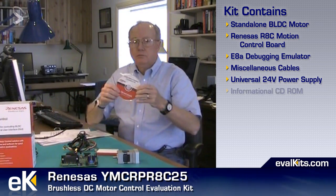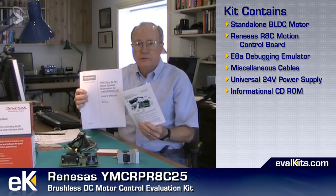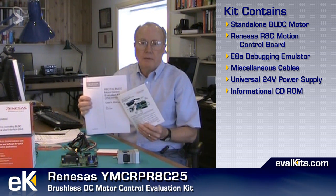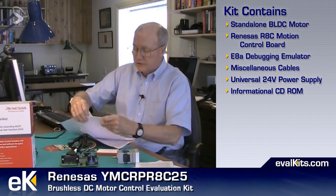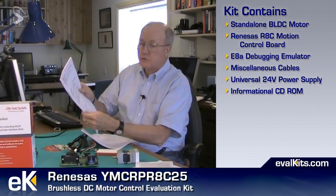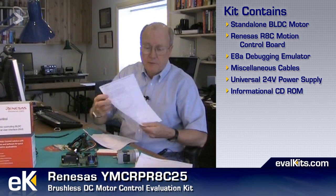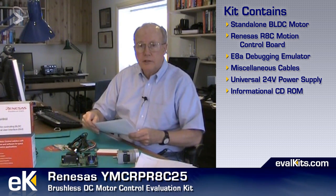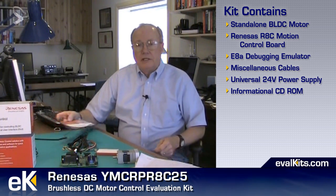The kit also includes a CD-ROM with a tremendous amount of information. I printed out the user's guide manual from the CD, which you can use in addition to the quick start guide to go through the two types of applications: the Hall effect sensor as well as the back EMF measurement to control the motor. The CD also lets you print out application notes on brushless DC motor usage, three-phase BLDC motor control, trapezoidal control, software listings for the C programs used in both Hall effect and back EMF measurement, schematic diagrams, bills of material. There's a great manual navigator within the toolset that the Renesas CD installs on a PC, allowing you to see what's there, get sample code, and print out manuals right away.